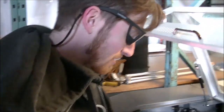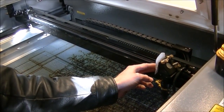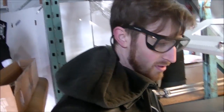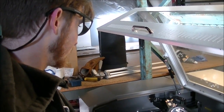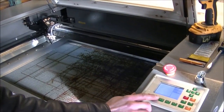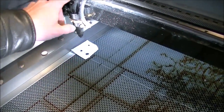Got to get a bit more scientific now. Take a little corner of the paper — you actually got to hold that right in front. Could've hit my finger. Skin does laser. It's a bit off but not terrible. We have to make sure it's aligned along the whole length. That's not a full beam though — you can see it's kind of small, which means only a bit of laser is getting through. So we do have to adjust this mirror a bit.